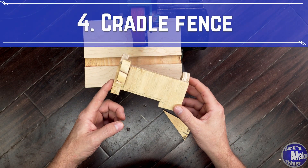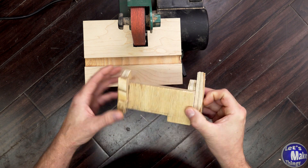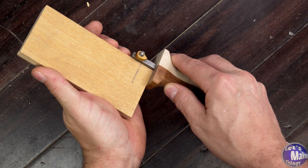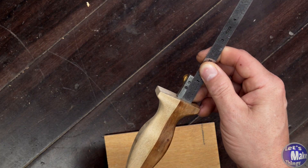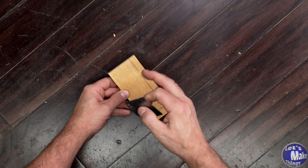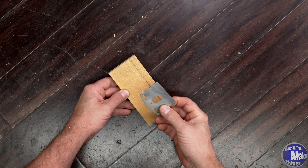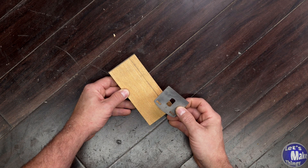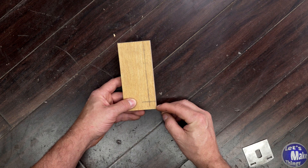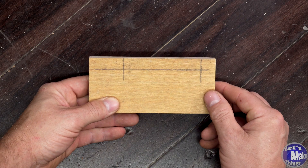The cradle consists of three parts: we've got the fence, we've got our back supports here which are at a 25-degree angle, and we've got what we'll rest our blade against. I'm going to set my marking gauge to 5/8ths. Now I'll set this to a half inch and draw a line that intersects it. To add my last mark, I want to take the widest blade that I have and add that to the inch for my belt. My widest blade is 2 and a quarter inches, the belt's an inch, so that makes it 3 and a quarter inches — but I'm going to jump up to 3 and a half inches. And because I started at 5/8ths of an inch over here, I'm just going to round it to 4 inches total. This is my opening right here that I need to cut out with the bandsaw.